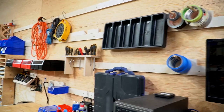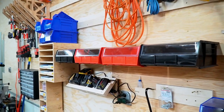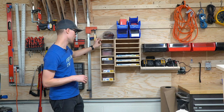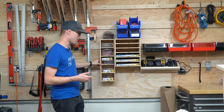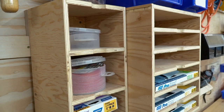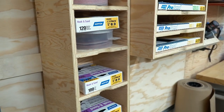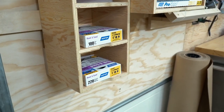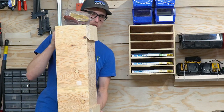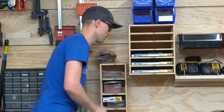We love French cleat — it's just the best thing for woodworkers or anyone in a shop trying to organize. We built these sandpaper organizers: took about 20 minutes to design in Fusion, measure out, flatten pieces, set up the CAM, and within an hour you can glue together your own simple creation. If you want to reorganize it, all you do is drop it onto a new cleat — it's just a 45-degree angle on the back.